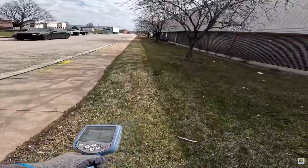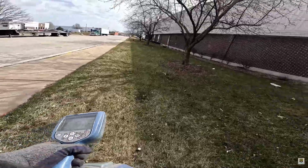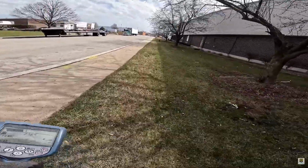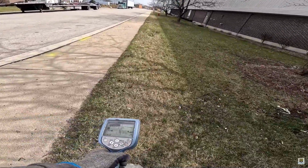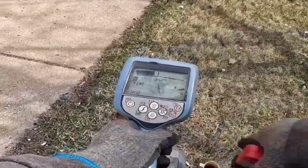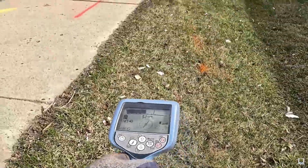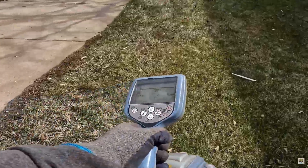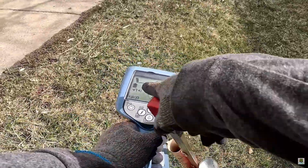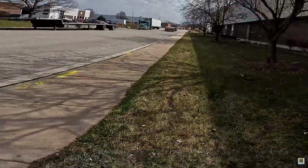and then you lose your tone, a lot of people would just go up with it and say, oh, I got a tone here. And then they'll start marking this poor tone here because they bumped up their gain. So I'm right here, I'm at 40%. Now I'm gonna lose it one more time. I lost my tone. I'm not bumping this, because when you bump this up, folks, you're bleeding off onto AT&T.